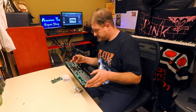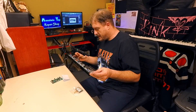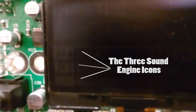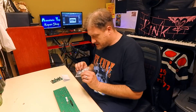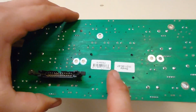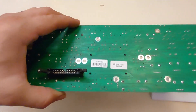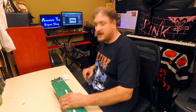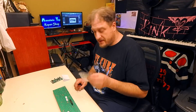Taking a nice close look at this - this thing has no power yet and those things are lit up. Looking closely at the old display, we can see there's still something being shown on the display despite the fact that it has no power. We'll need a soldering iron but we're not actually soldering anything - that's a ribbon cable. It has four studs in the back of it. Looking at the back of the board, you can see they just push the studs through and then melt them - kind of like a plastic rivet. I'll have to do the same thing with the new one.